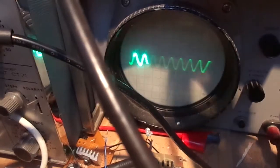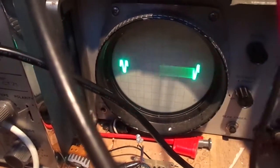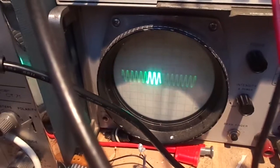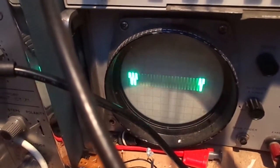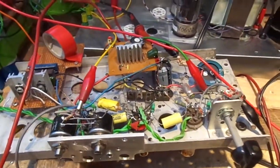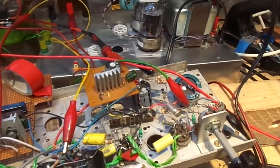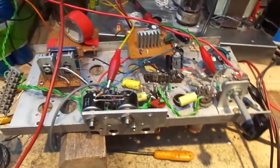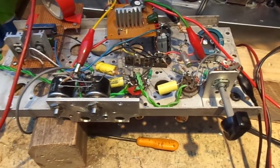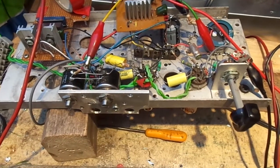So let's just muck about with that. Hold on. Frequency 100. Oh shit, that's 100 kilohertz, you peanut. Frequency 100 hertz. Yeah, and it's still 2%. Frequency 150 hertz. 1.5, yeah. So at lower frequency, just knock that back up to 1 kilohertz. No, let's knock it down to 440 hertz. Where was I? Yeah. Low frequency response, not very good.